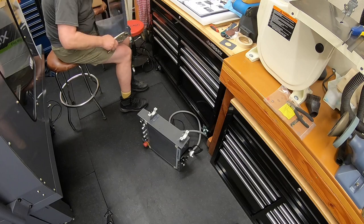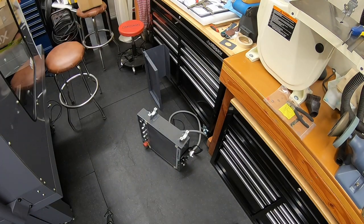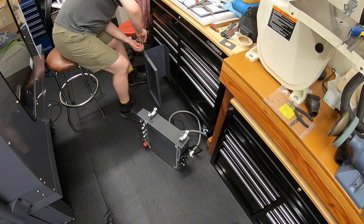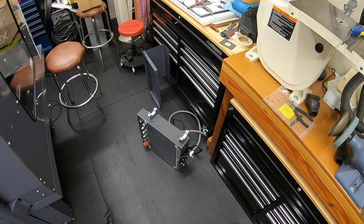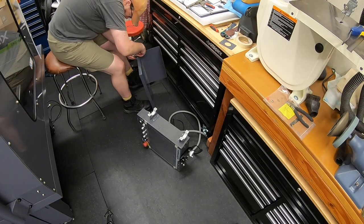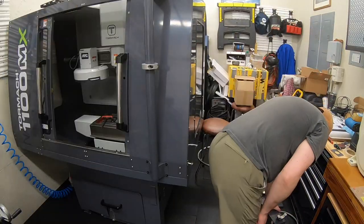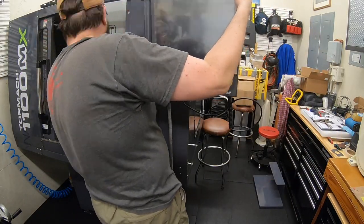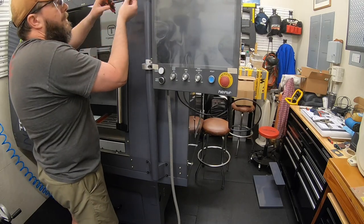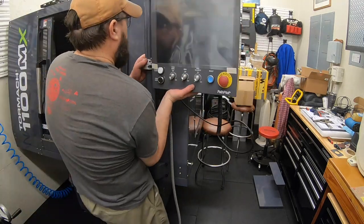This was the other bolt that I had issues with. I went to screw one of those in there and got stuck. So I just grabbed a 10-32 tap and that went nicely into the existing hole. Didn't have to drill it out at all. And then just stuck a 10-32 screw in there to fix that one. So that was my third screw that I had issues with on the whole build. And probably just me. I probably just cross-threaded it going into that hole and caused the problem. So took care and fixed that one and got it together.